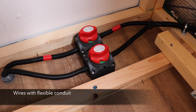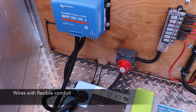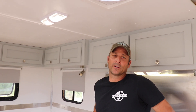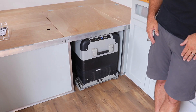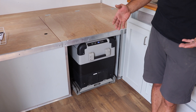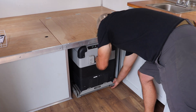I've been running the solar all day and everything seems to be operating as it should. I've had most of the lights on for the majority of the day and I've been running the fan off and on, and everything seems to be working just fine. But really my main concern was the 12-volt Dometic cooler — whether my battery and solar panels would be able to keep up with it. So far so good: the battery is still showing just a float charge, meaning the solar panels are doing their job and not drawing down the battery at all.